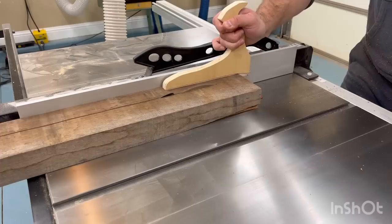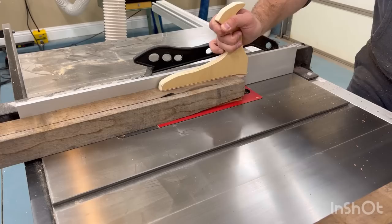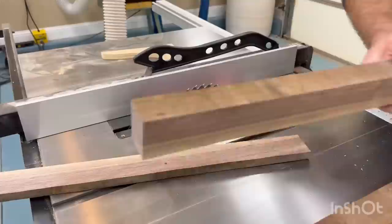The reason I'm cutting these larger pieces into strips is because by doing so and rotating the boards, I'll get more consistent and straighter grain lines on the final glue up, which will make the final board look like one cohesive piece of walnut. Additionally, rotating these strips will help stabilize the seasonal movement of the board and will help keep it flatter over time.